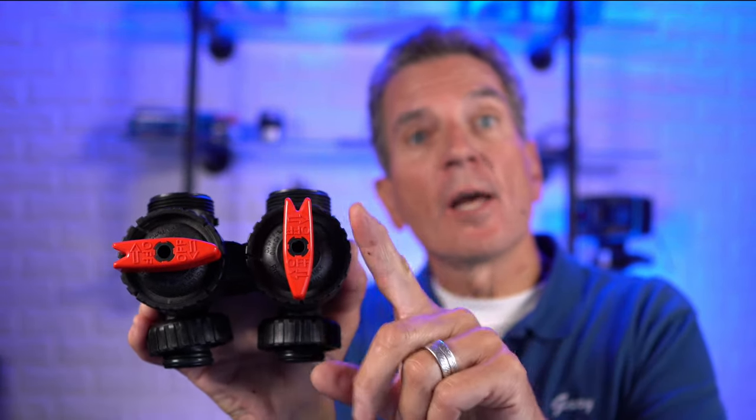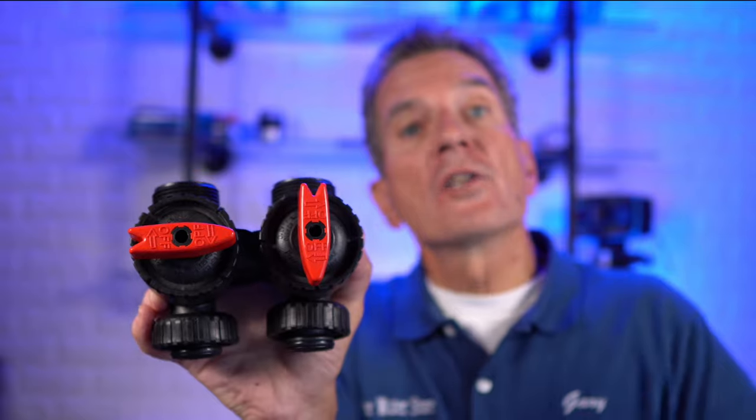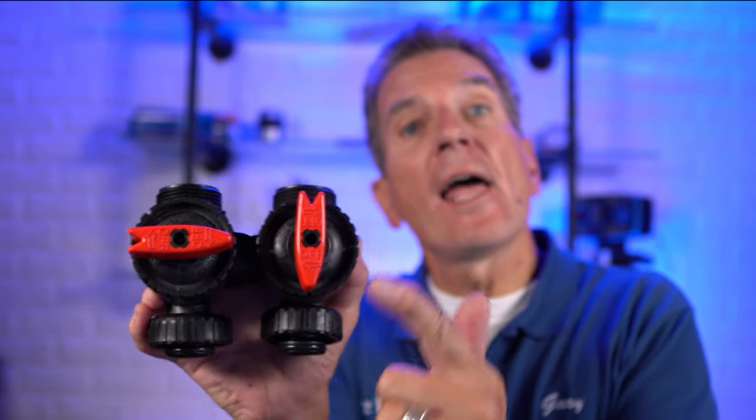In bypass mode you can do work to diagnose the system, and when you first install the water softener you would use this mode to flush out any debris and get rid of the air out of the water softener before you hook it up to the household plumbing. The last mode is shut-off mode, where you turn the inlet valve to the bypass position but leave the other valve open, so no water enters and no water exits. It's a great way to isolate the water supply after the water softener.